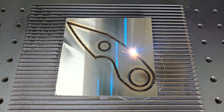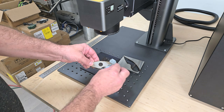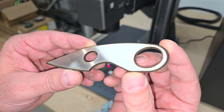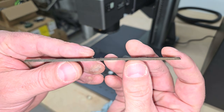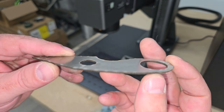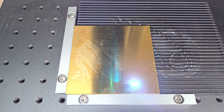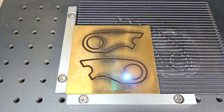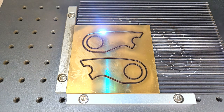1084 carbon steel or tool steel are much better choices for knife blades. This took around 3 hours to cut, which isn't very fast given that I could have done this by hand in about an hour, but it's not like I had to stand there and watch it either. I put some of that time to better use by drawing up some scales to cut from brass and 3D printing a sheath for the blade. You could also use the laser to just mark the blank on the steel and cut it out by hand instead of using paper templates — some things would be faster that way, but a laser saves time and frustration with more complicated designs.